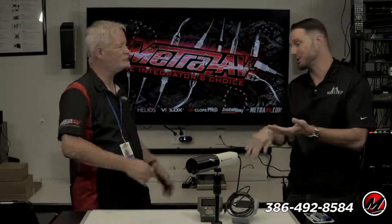Right, and some of the other manufacturers have it set up in such a way that the adjustments are extremely granular, and that's what we like to see. If I go one click and it makes a tiny difference, good, because that helps me hit some of my targets even better. But if one jumps up way too high or one jumps down way too low, then you have to figure out, okay, how can I make this control work in our favor? And for the audio guys, that's a 6 dB detent instead of a 1.5 dB detent, which is what you want. Yep, good observation there. It's exactly right.